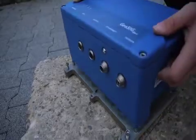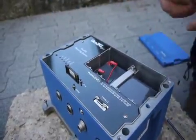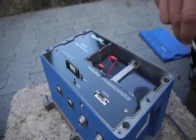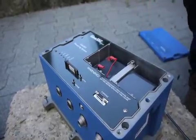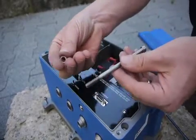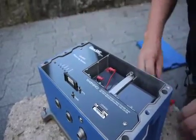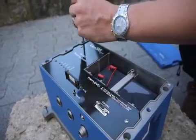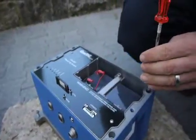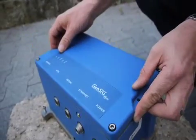Place the GMS and remove the cover. Put in the mounting screws that secure the GMS to the base plate. On these screws you'll see a small washer that you also need to place on. Tighten them down securely. Place the cover back on and tighten down the cover.